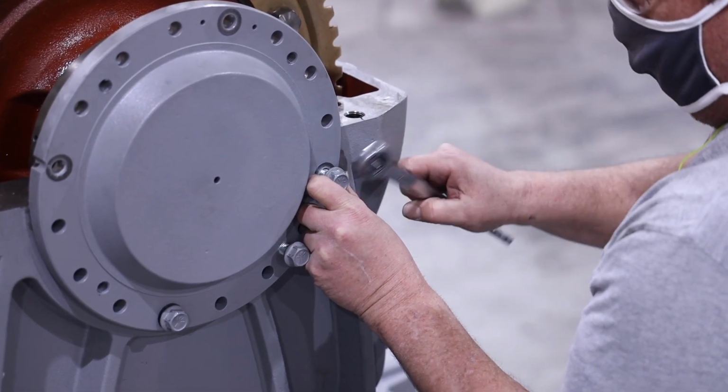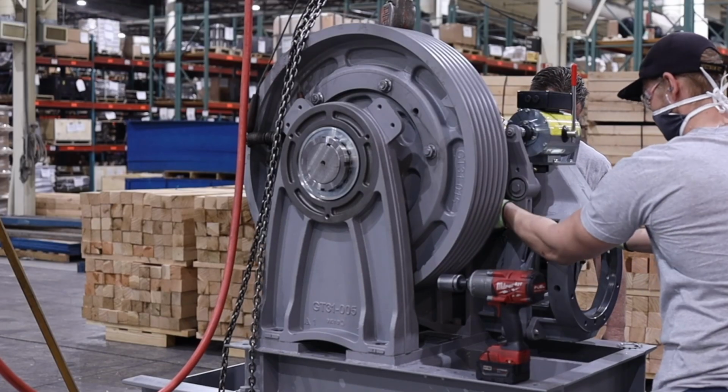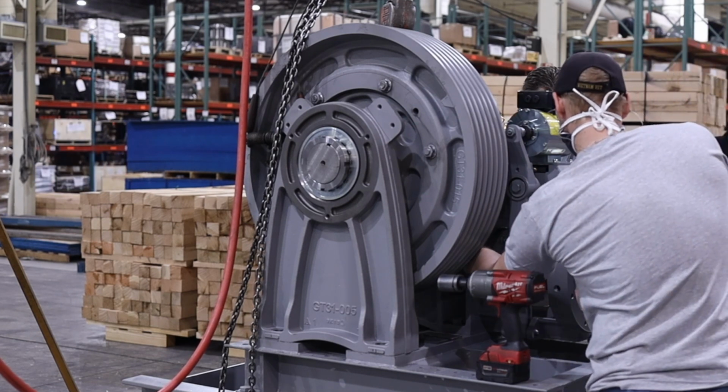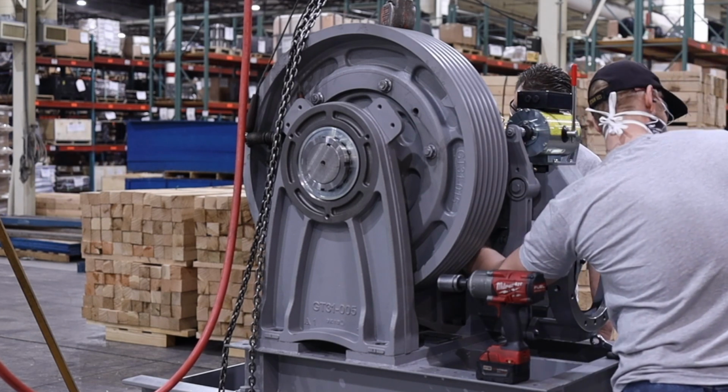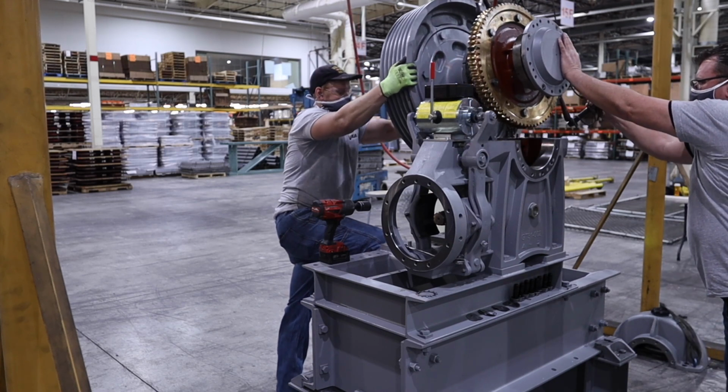Note the number of shims under each bolt as they are removed. Also, remove the 2 lower inside housing eccentric bolts. Note there are not any shims under the inside eccentric. The center assembly can now be removed by lifting it straight and level.